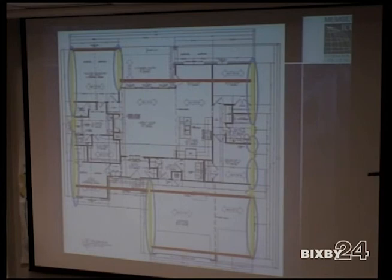So remember your chart on the back that we gave you, okay? That'll tell you if you can count that as a panel. You got 10-foot ceiling heights on that. You got 6 foot or 60 inch. Right. So you gotta have a 30 inch wide panel to be able to count it towards bracing, okay? And we didn't have that much between those windows. Right. So that was the reason why you had to go to the continuous sheeting portal frame. Now you can count that little panel on the side towards bracing, within your 25 feet on center.